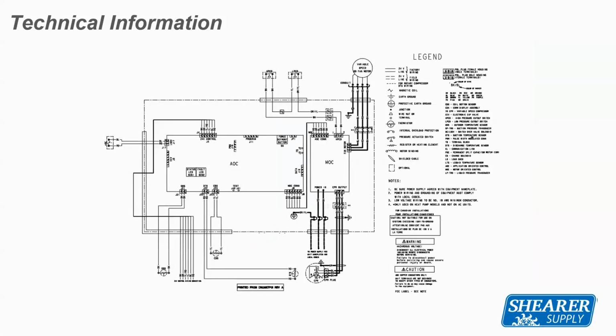And again, we talked about the wiring diagram. It's actually pretty simple. It's probably halfway between what an inverter one is and a regular 24-volt system. But these are going to be standard sensors, standard high pressure switch and low pressure switch, stuff that you're used to in the past.